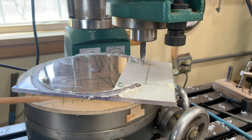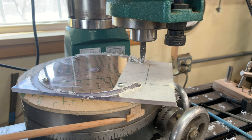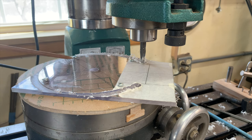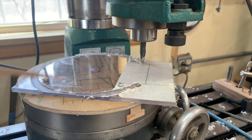So then I raised the material off of the rotary table by just means of this quarter inch packing here. And unconventional as it may seem, I have used pieces of wood. I made T-slot bolts, if you will, out of wood, so that I could just take some screws and go right down through those pre-drilled holes and hold all of this down. These pull up on the T-slot material and hold it reasonably rigid.